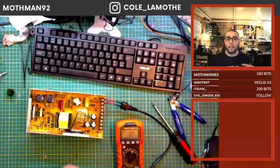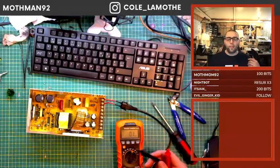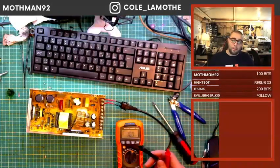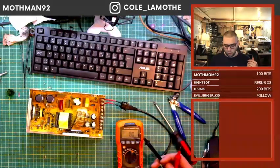differential measurements, systems like UART, which is what you tend to use, like CAN bus, which is what your car uses. So your car would communicate up and down the car between different systems: your fuel gauge, your backup camera, your tire pressure monitoring system, all those pieces. They'll be zipping communications back and forth with high speed CAN bus, which is asynchronous serial transmission or something like that.